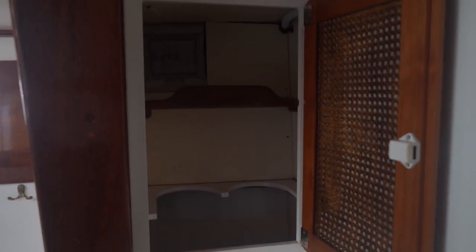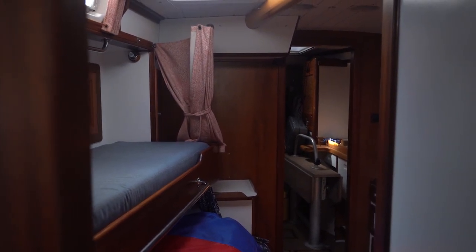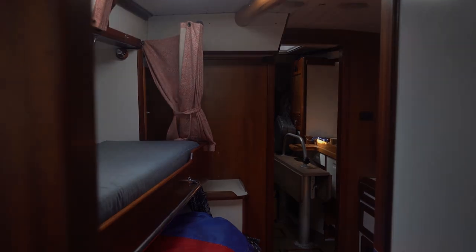Still in the galley — I opened the cupboard here. This is a little tea corner that holds two hot water dispensers. You can get hot water going and no need to boil water when you're on watch — enough hot water to make tea or coffee. We can also see into the hull liner: the hull is insulated with sheets of 32mm expanded polyethylene — two layers — so the entire hull has 64mm of insulation. Really nice — going to keep the boat toasty or cooler in the Caribbean sunshine.